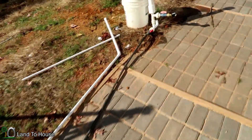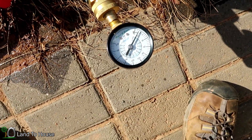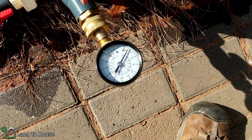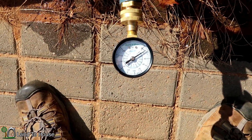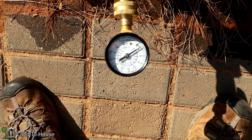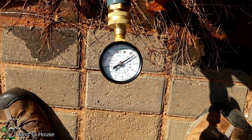It's fun though to see the pressure wave flying through that pipe. It's been almost two minutes — let's see what we have down here. Pressure is around 15 psi right now. We'll give it another 30 seconds and see what we're getting. It's been two and a half minutes. It's 15, maybe 16 psi, but I think 15 would be close enough to call it on this one.